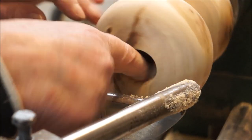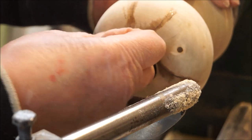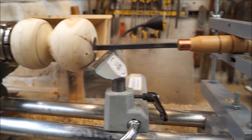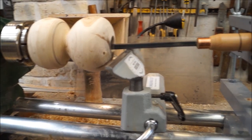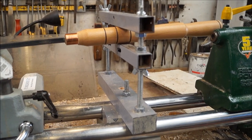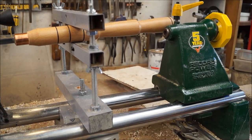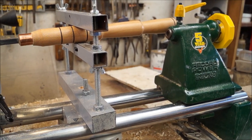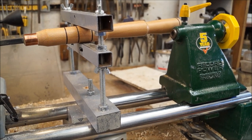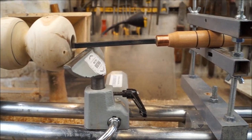There's lots of dust coming off, not shavings, but it's coming. It's round about here now — about that far round — so I'm quite happy with that. I've made this piece too long. The lathe's too short, and using my Glenteagle hollowing tool the handle hits the tailstock. On these Record Power machines it's a bit of a nuisance to take the tailstock on and off all the time. You've got to get the bolt to line up in the right place every time, otherwise the handle's in the wrong place. So once it's on it's staying there. We're going to shorten this off now — I've penciled a line there, so I'm going to part this off and remount the piece back in the chuck.